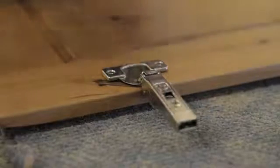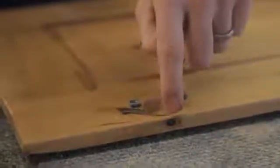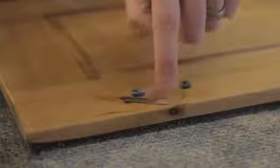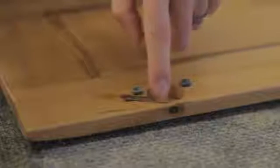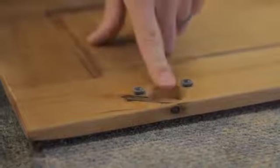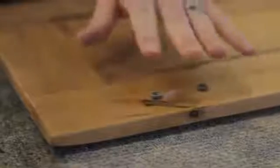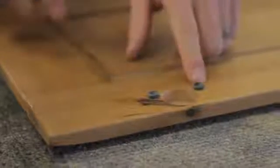What's important with that, I guess, is just to make sure that your hinges that you're replacing don't have to be the same kind. But this hole that's right here actually has to be bored the same as the hinge you're putting in there. So it would be important to double check the hinge you're replacing before you buy a new one, because you don't want to go buy a hinge and then have to go and replace it.